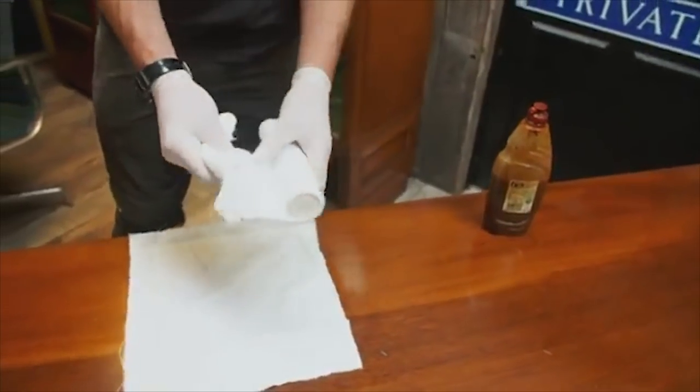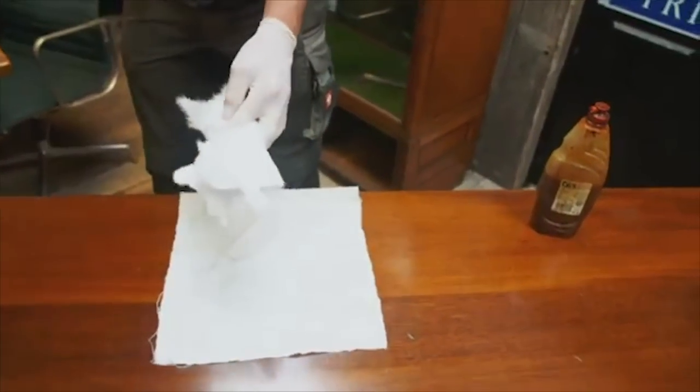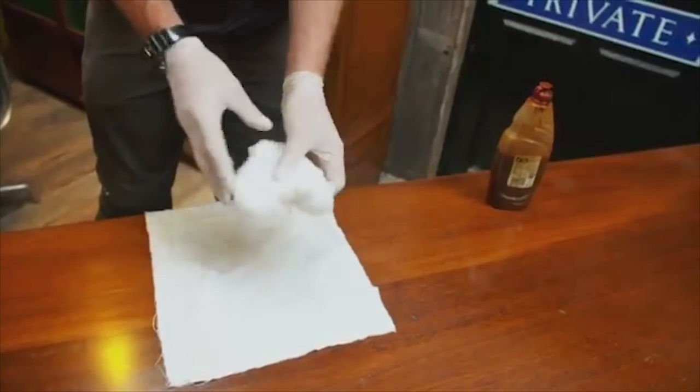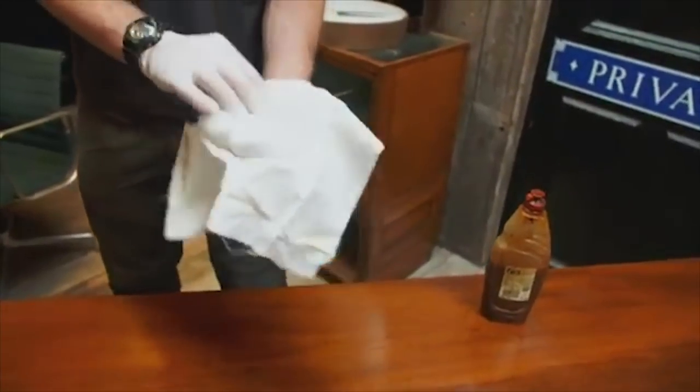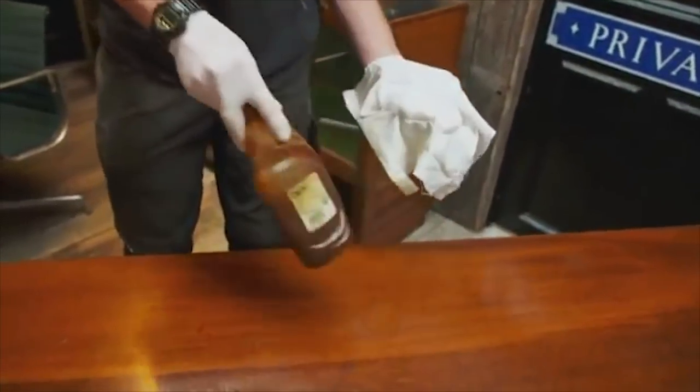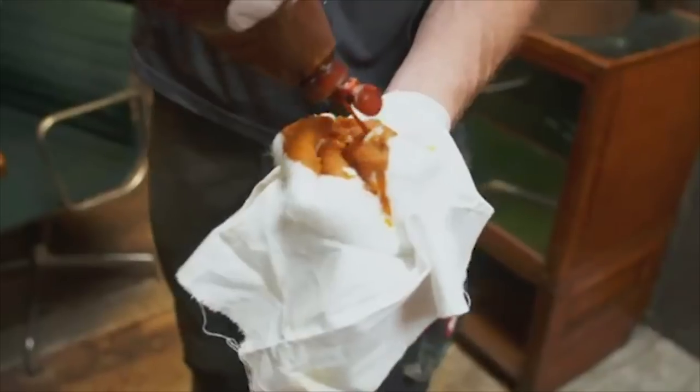We've left ourselves with a matte patch where the stain was, so we need to traditionally French polish the whole top to give a nice uniform finish right the way across. We start with a soft cloth and some cotton wool — tear off a ball and fold it to about the size of an apple, then pop it in the middle of the rag. In our squeezy bottle we have half French polish and half meths to thin down the mixture. French polish in its pure form is a little too thick to apply with the rubber — that's why we use a brush for the first coat. For this fine finish on the top, we dilute it to 50-50, use the rubber, and get a much better finish.